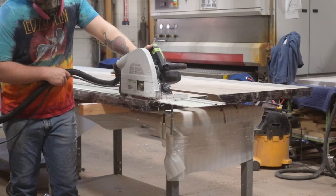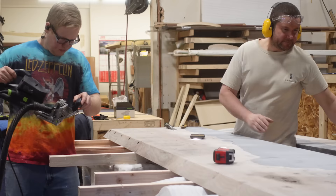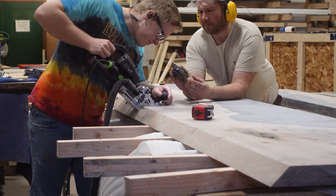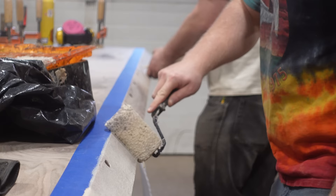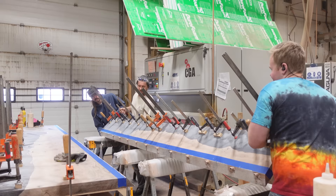After we've got that giant miter cut we've got to work fast so this wood doesn't warp. We're using the Festool Domino to help with alignment on this joint and give a little bit of strength. Some people have noted in the comments that dominoes don't add strength on edge joints, which is correct, but I'm not sure that's true for a miter like this since a mitered joint is slightly weaker than an edge joint. Maybe someone smarter can comment on whether dominoes actually add strength on a 45 — it may be something we'll have to test in a future video.